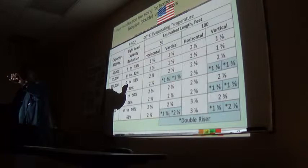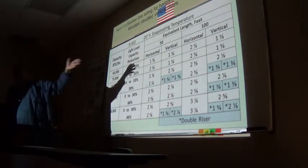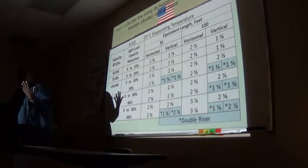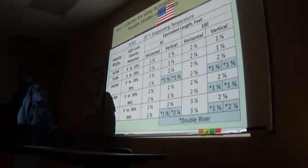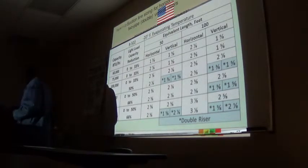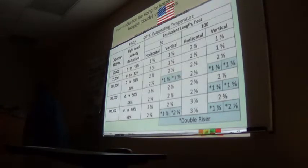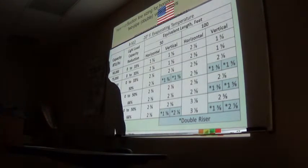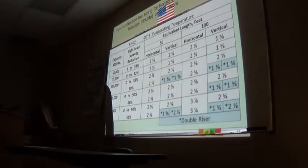A stupid thing like a pressure transducer can take you 10 to 14 days to get here. If I order the board, I have to build the board. If I order the valve, it's the electric expansion valve. This is not a stock item for the simple reason it's too expensive. They have to build it. They make it when you order it? Yes, they make it when I order it.